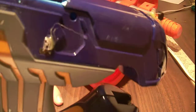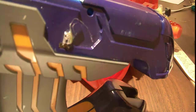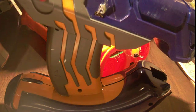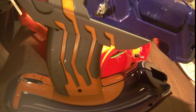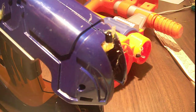The way it works is that pulling the trigger is essentially pushing the button for an IR remote, like this one here. This trigger is the same as pushing the button. This receiver is like the TV — it receives a signal. It's a 38 kilohertz modulated IR receiver, TSOP 382 or something like that. SparkFun sells them, they're pretty cheap — like two bucks.